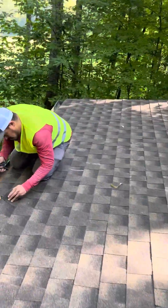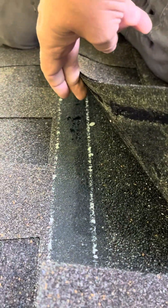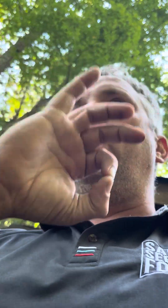So that's what we're performing here — I wanted everybody to see that. I'll be glad to draw it on a piece of paper and let somebody take a look at it, but that's ultimately it. We're going to have all this caulk off the top of these shingles here shortly, and every single shingle underneath sealed like we're describing. So we're sealing that — there's no way the water can travel this way and get in there. That nail is almost a foot over, so there's no way the water goes that far. This was exactly what we're going to do to resolve any possible issues and make sure this roof never leaks again. All right guys, appreciate y'all watching. I'm Kirby Smith — see you later.